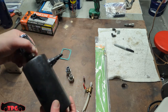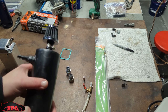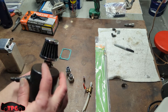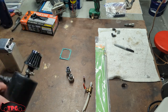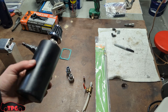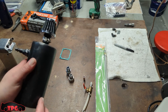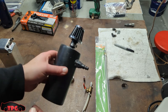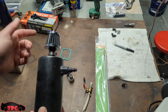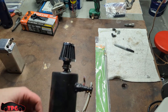You guys may remember this guy. I did hook this up in the car and ran it for a little bit. Some of you guys were like, how do you drain it? Well, just unclamp the hose, take the filter off, flip it and pour it out. It did work — it was okay. However, it was crudely mounted. I didn't put a mounting point on the back of it — no bolts, no straps, nothing to really hook it up to. And it's also got a breather on the top, which is a no-no for a DSM PCV system. You're supposed to have a closed system.